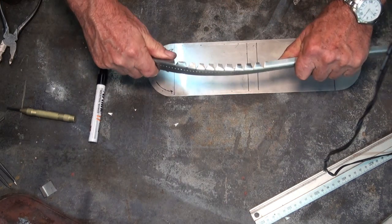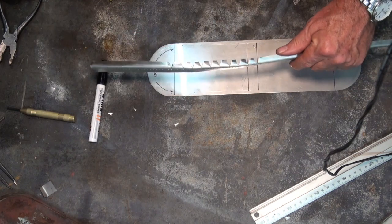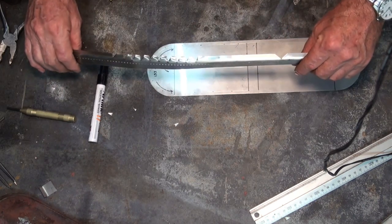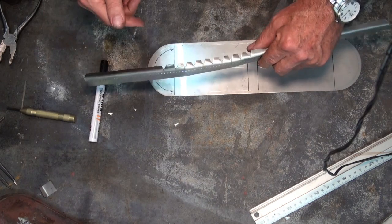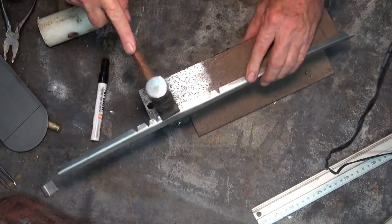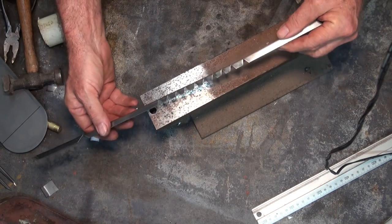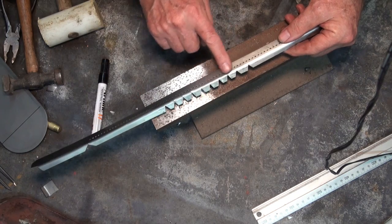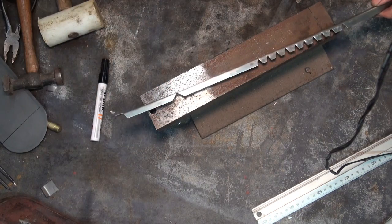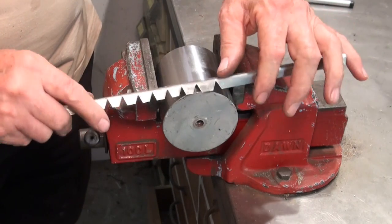Okay, so that makes that flexible now, and it's going to be possible to form that round in the curve that I want. There's a lot of distortion on this section here, so I'm just going to planish that out and get that smooth and flat, and then we'll go ahead and we'll try bending this round a mandrel. Alright, so that's got rid of the worst of the distortion now. So I'm just going to get the correct size mandrel, and we'll try pulling this around. And then we've just got to make a right angle bend here, a right angle bend here, and it should go together. So I've got a mandrel in the vise here, and I'm just going to gently bend this round